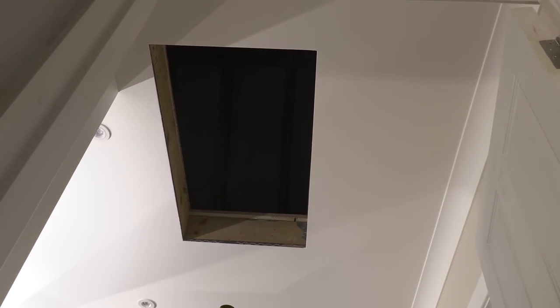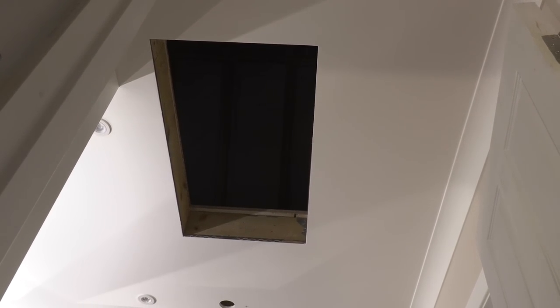We just put some angle bead around the opening. Although that's reduced the actual opening size by about 3 millimeters, or 6 millimeters either direction, it's still okay to get this in. But I checked that. Worst case, we just knock them off because it's going to have an architrave around it anyway. Yeah. But you put that so the plasterer had something to finish to. Exactly, so you get a nice finished job. If we come to it and we had to knock them off, it's not the end of the world.